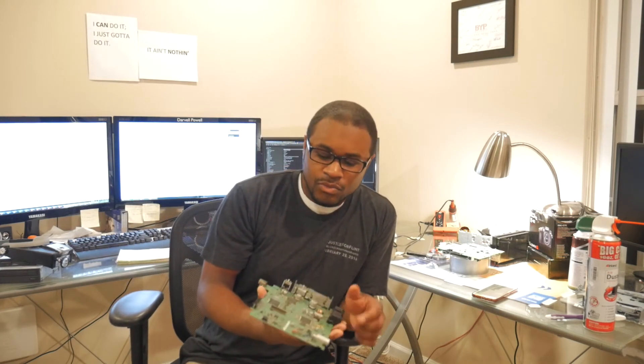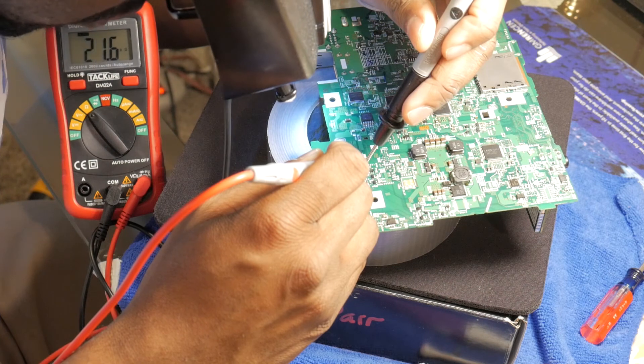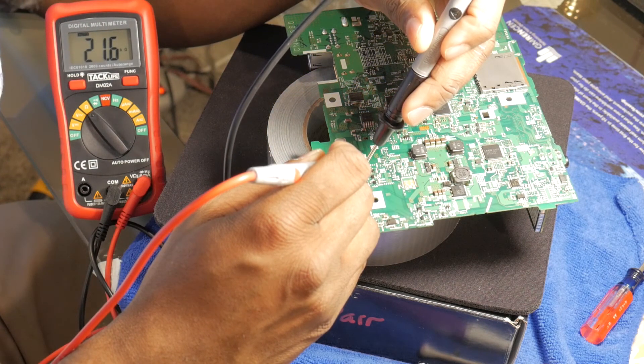What I actually did was take apart my original GM factory radio, pull the main board out, and use my multimeter to find a resistor close in value on that board. It came up as an 18 kilohm resistor. I placed that on the Pioneer board, which took a little work, but I got it on. When I checked the test points around it, it was coming in at 21.6 kilohms. There could be resistance in the PCB traces leading to it, but when testing at either side of the resistor's leads it reads about 21.6, so I'm happy it's in place.